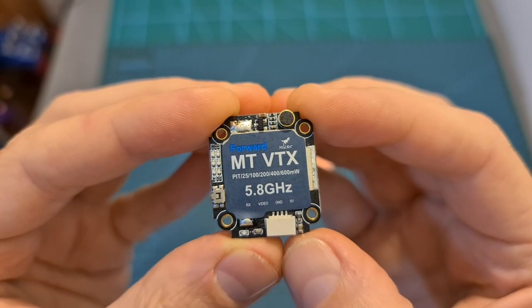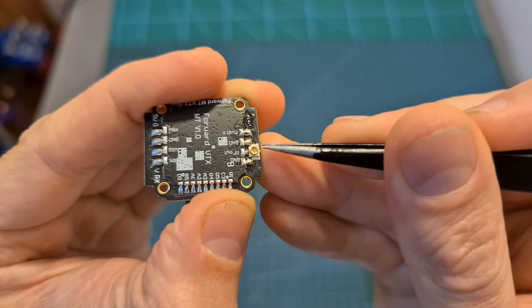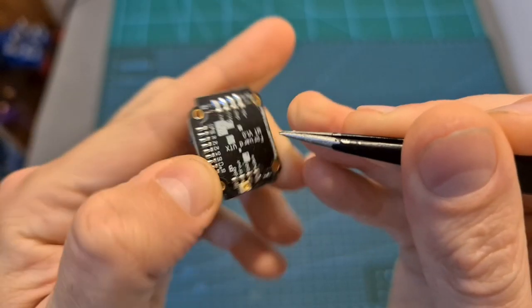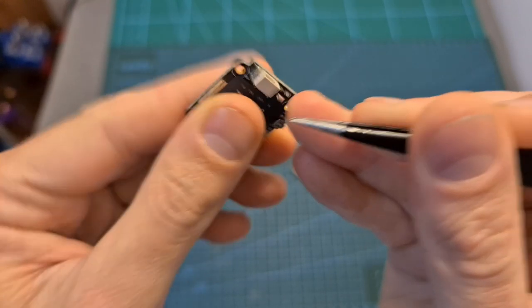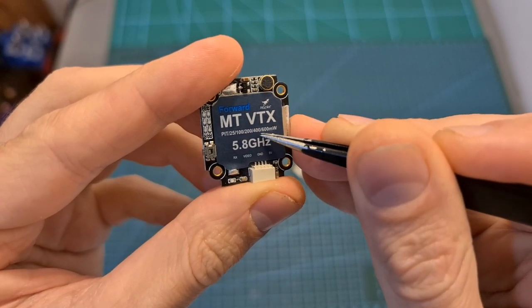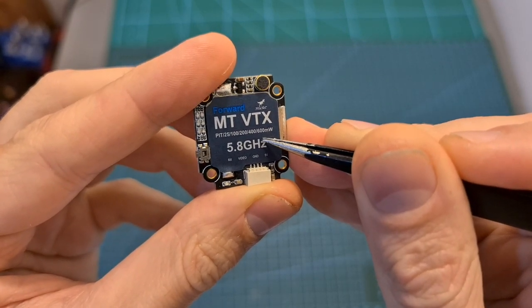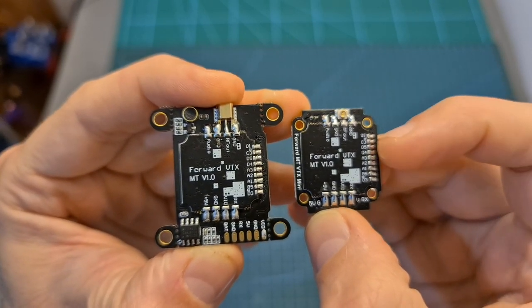The mini version is using 20x20mm M2 mounting holes. It's using a UFL antenna connector. Its DC input voltage is restricted to 5 volts, and it has a selectable output strength of 25, 100, 200, 400, and 600 milliwatts. So basically, as you can see, both VTXs share the same transmission module, and the main